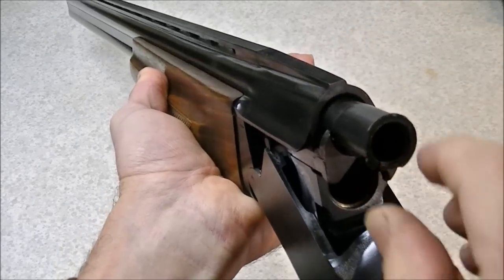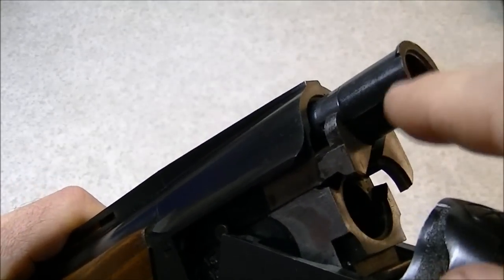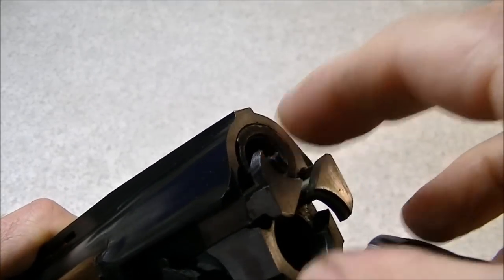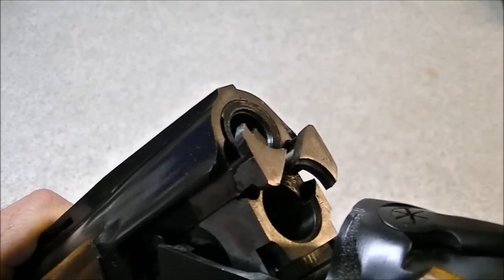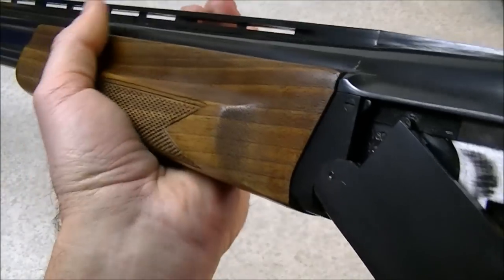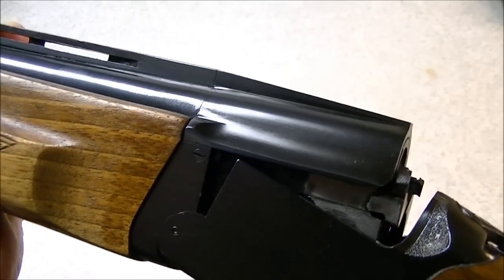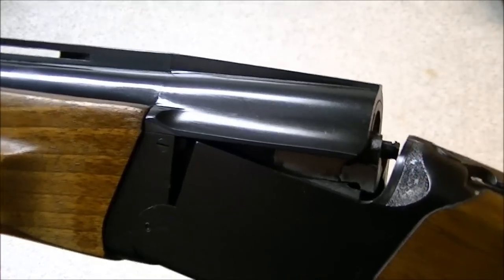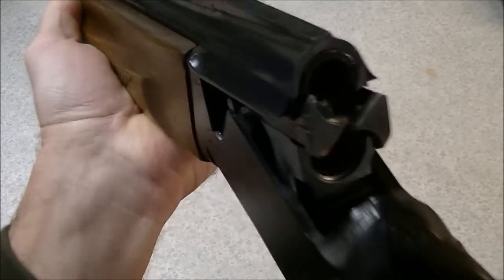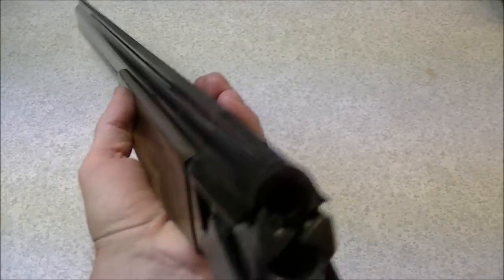Push the tube down and have the extractor line up with the extractor or ejector of the shotgun. You can see the extractor is lined up with the 20 gauge extractor on this gun. It's important to be careful when closing the gun up to make sure the extractor is pushed in enough so as not to get caught on the breech face. You can see it'll stick out a little when being closed — make sure it doesn't catch on the top of the breech. You want to be careful not to break that extractor off, as I don't know how possible it would be to get a replacement.